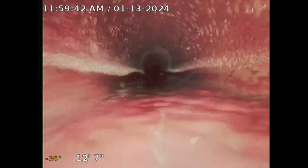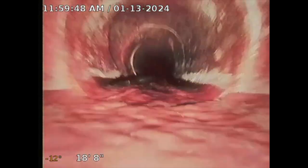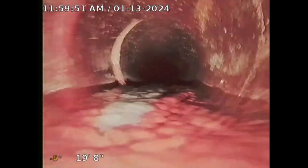The sewer line is ABS — it's typical for newer sewer lines to have ABS. I don't want to see any standing water. Right here we see a little offset with clay. So that's where the clay starts. I got past that — so now that's clay, and that was a little joint offset. Once I get to the main city sewer saddle connection, I'll turn the water off and then come back dry just to see that again.